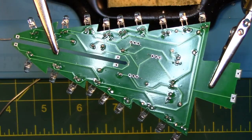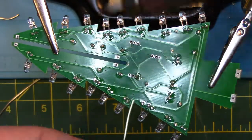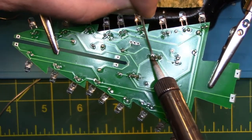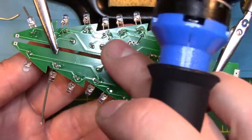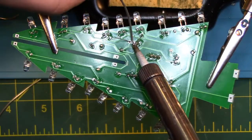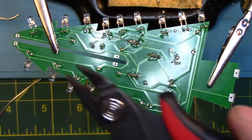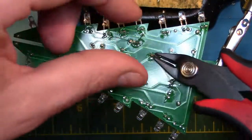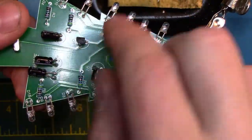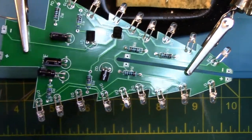Now we are going to solder the three transistors to the board and clip the legs of the transistors off. Bend the transistor located in Q2 over 90 degrees, so it'll allow us to fit the other circuit board between them. I ended up bending over all of the transistors in the end.